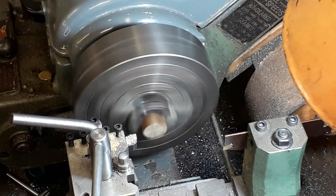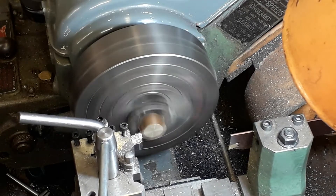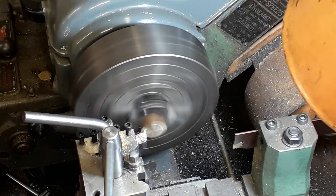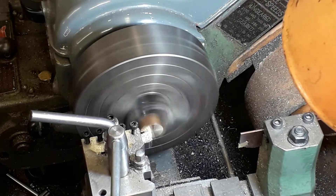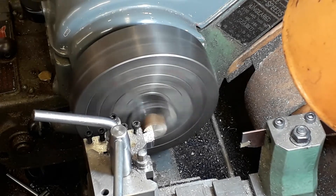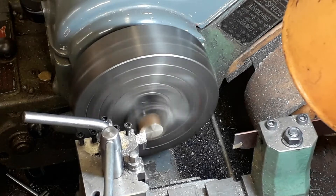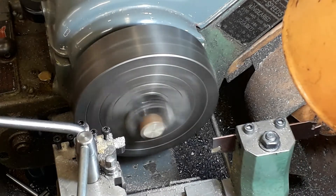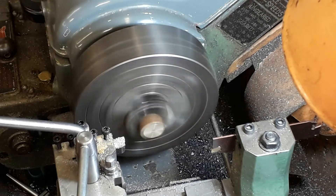Here's the eccentric strap set up in a four-jaw chuck. What we actually did is we centered it on the outside edge using a DTI. Another quick visual check I did - just before we faced it off I ran the tool just around so we put a circle in the center and just made sure it looked like it was in the center of the brass casting. So we just faced this off to give us a nice finish on this side. When you're mounted in the four-jaw, notice there's enough clearance - it's 7/32" wide when machined, so we've got enough for parting.